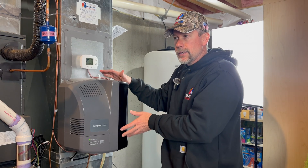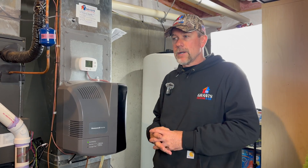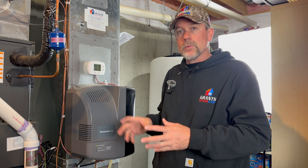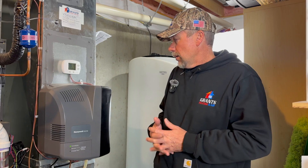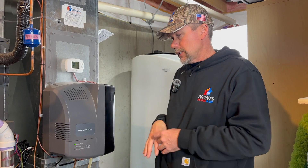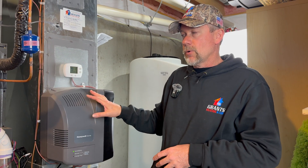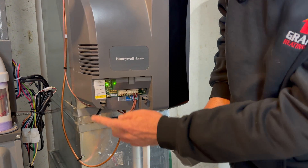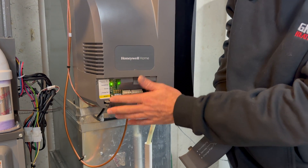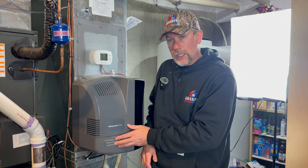Regular maintenance is very important — during maintenance we clean inlet filters, put in new pads, and clean the trays. When there are too many minerals in the water we use steam humidifiers, which actually like minerals, using them to create an electrical path inside the canister to produce humidity. One important thing with these humidifiers is to have a leak detector underneath them. There's also a door you can pull to reset the pad, and the lights do a little sequence to confirm the reset — something other humidifiers don't have.